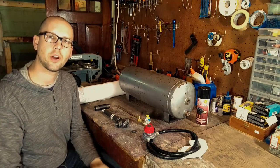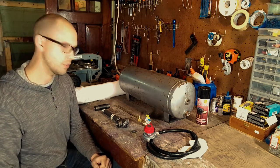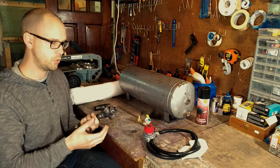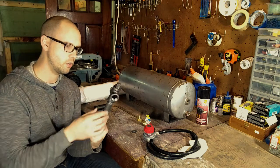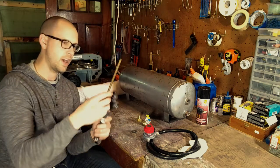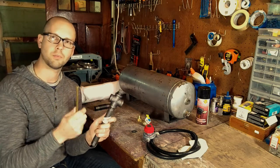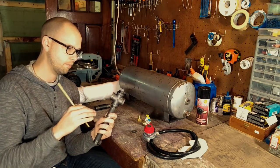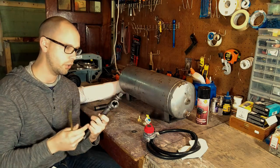I'm getting ready to build my burner here and I'm just going to talk quickly about the fundamentals of how the burner works. Basically what you have is two air inlets — you can find all these parts on my previous video to see exactly what I used. You've got two air inlets, you need a gas supply that's basically perfectly centered in this pipe and has a small nozzle, and what that does is rush the gas in super fast through a tiny little hole and then suck air in to mix with the gas.